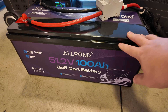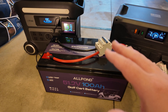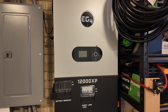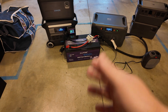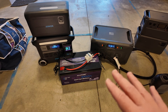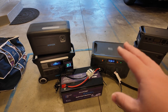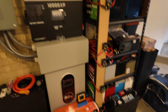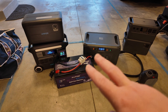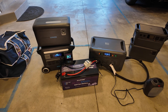Because this is the type of external battery it is, it will work very well to expand your portable power station. But because it's just a basic 48-volt battery, you could also hook it directly up to a 48-volt inverter all-in-one unit and utilize the power that way. So for less than $750, I have a battery that fits multiple use cases: I can expand my portable power stations on the go in my RV, and when I'm not using it for that, it can be part of my whole-home power backup solution. My investment gets used twice, and I spent less than if I'd bought one proprietary expansion battery.